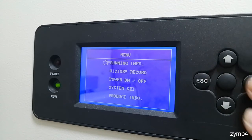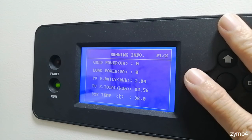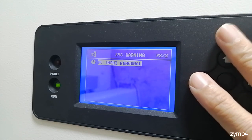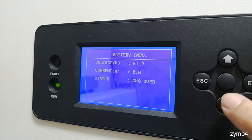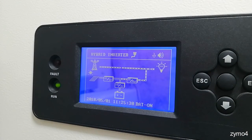Just to double check — okay, that's correct. Checking running info: temperature is fine, everything is okay, no issues. PV input shows abnormal because we don't have any PV at night. Battery is on — it's 'charge over', same as before, nothing changed. Your inverter is now ready. Every time there's a storm, go back to your settings, no need to shut down the inverter — just set the timer to e-save and you'll be good. Your battery is preserved.